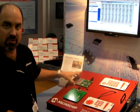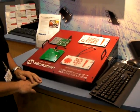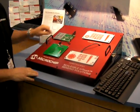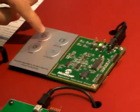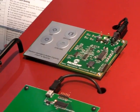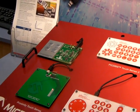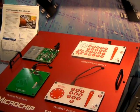Something that we just released is our new inductive touch solution. Inductive has a couple of advantages over a capacitive solution in that you can use gloves, or you can have liquids such as water or oil. It works off of a deflection of a metal plate, so it also could be in metal, which is very vandal-proof. It can also be integrated into a larger enclosure, such as a washing machine, where the buttons can actually be part of the enclosure itself. And it's highly robust against noise or any type of electrical disturbances.